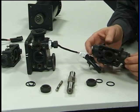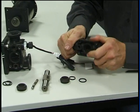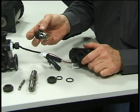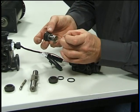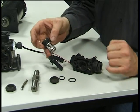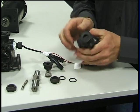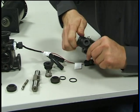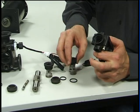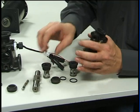Also in the heads we have check valves which allow the plunger to generate pressure and chemical flow. These check valves are just steel seats activated by springs internally and can be cleaned and the O-rings can be replaced. We have an intake and an exhaust check valve on each end.